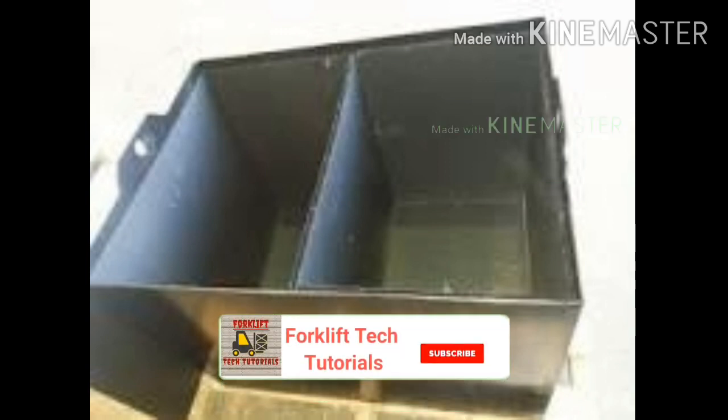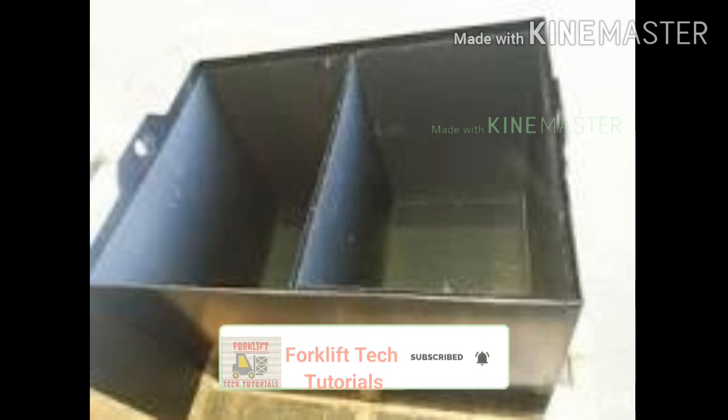Battery tray or tank. The battery cells are contained within a tray or tank. The tank is made from metal which has paint applied on the inside and out. Most trays are coated with a plastic paint that is acid resistant. Many trays fail due to battery acid getting into the tray, so having it painted in an acid resistant paint is very beneficial. Most trays have drain holes designed to drain off any water from the tray, which is accumulated from cleaning or topping of the battery. If the battery tray does not have holes, any liquid that is spilt in the tray would need to be removed with a suction drainage pump.